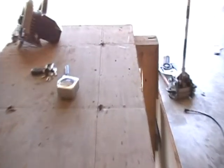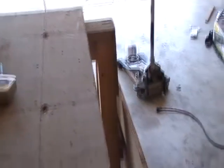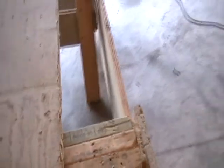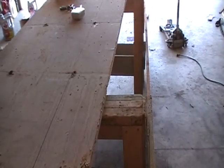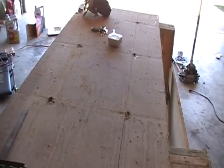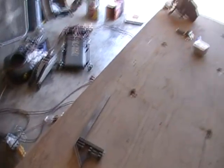Alright, I got this line made out — goes all the way down. What I'm going to do, since I know this edge is completely straight — there's a little hiccup right there but that's not going to make a difference — I'm going to cut this out, then flip it over, line it up with the line I have at this end and the line at that end down there, and draw my line. Because I don't have a chalk box, those two ends will be my guide. Then I'll cut my shorter piece out for the front on this side.